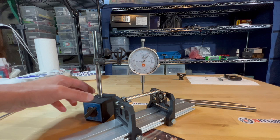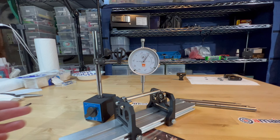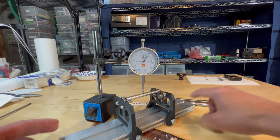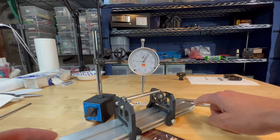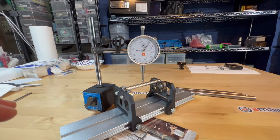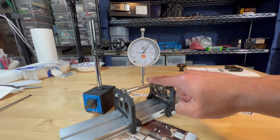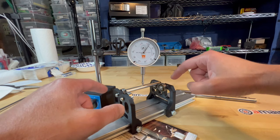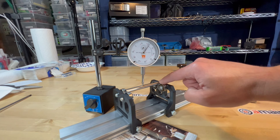The most important thing is that the base is not rocking or shifting around once I start measurements, though it would be ideal to have a ferromagnetic surface. I also have to make sure the arrow spinner doesn't shift around or rock on the table, as my table is not 100% flat. I use a little piece of paper to compensate for that, and of course here I have the shaft that I'm measuring.